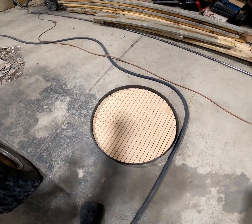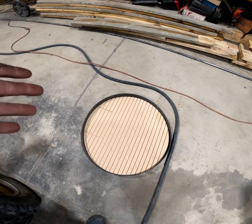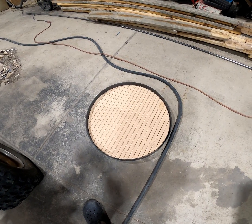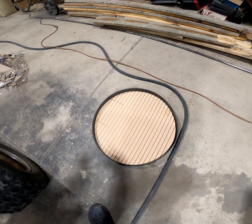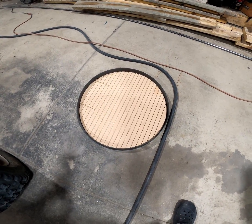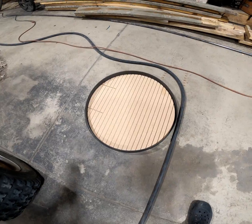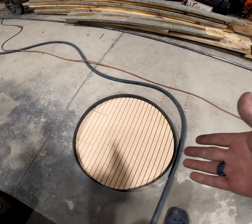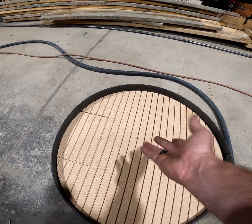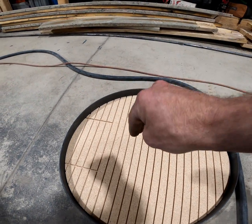So now you guys know why I spent the extra time to do that. So in the future, I don't have to dink around with this. I don't have to measure any of these. Like, it's there. I just drop them in and we're going again. I'll show you when I get the other circles cut out and get maybe a couple of these slats cut and put in there. They're tight. That jig is really tight for, I mean, it's 1/8 inch end mill, 1/8 inch steel. It's pretty spot on. It should hold them pretty perpendicular, straight up and down. That's the other thing with this jig being 1/4 inch deep. When I drop these in, there won't be any of this side to side because it's set, because they're snug. So I'll probably actually have to tap this a little bit to get it out.